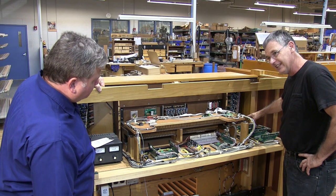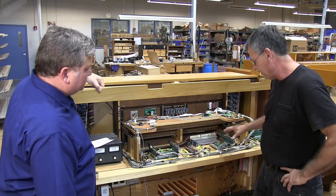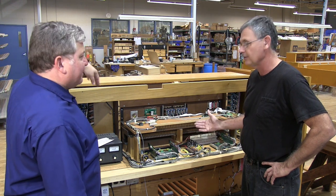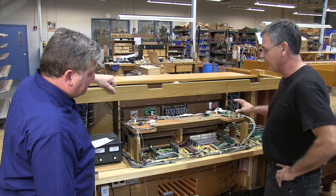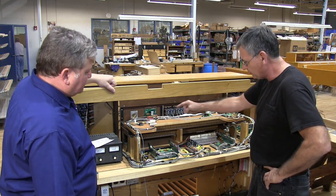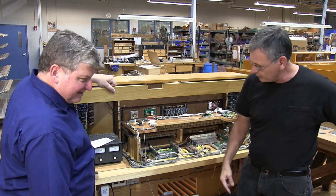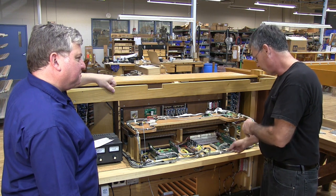Over here we have keys, and we have our draw knobs and pistons. And then we have another card that's called a driver, and that's actually what makes the stop move when you call for it. Oh, it fires the magnets to push them in and out. Right, so all this together is the brain, or the CPU, however you want to say it. Then this brain talks to the chamber through a fiber cable on this system. Just that one tiny little cable. It goes out to the chamber into a series of similar cards, and they all talk to each other through the fiber optics.